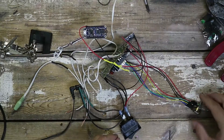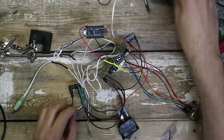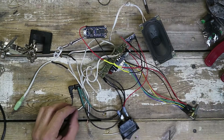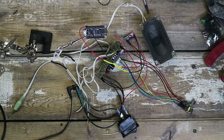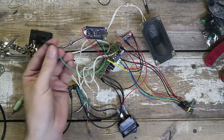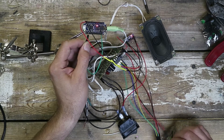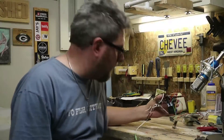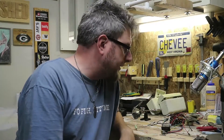Power is hooked up, potentiometer is hooked up, power light, speaker — make sure the wires are out of the way — let's turn everything on. Adafruit has power. Theoretically we run a jumper from ground to pin one and we should get a sound. Now that we have this whole mess together and working, and we know that it does what we want it to do, it's time to build a case for this thing.